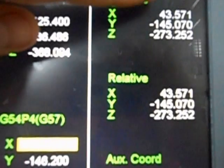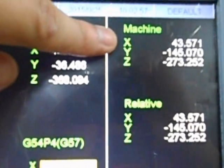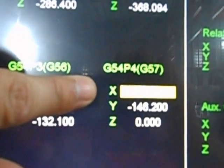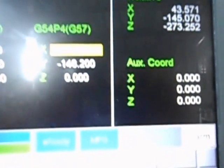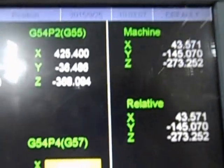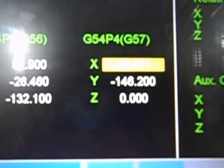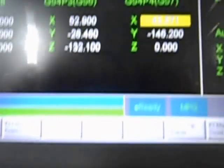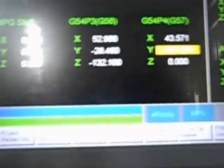The purpose of this is to put the machine coordinate into the G57 coordinate. That means this point's machine coordinate becomes the offset of G57 for X. Same for Y — I also latch the machine coordinate for Y.